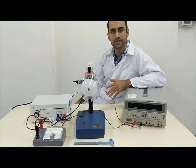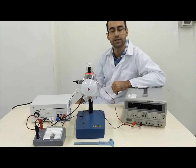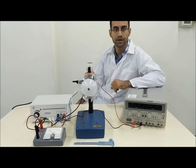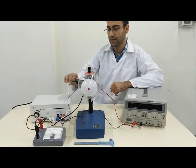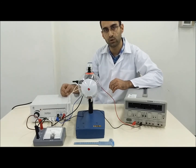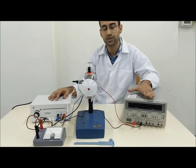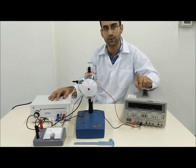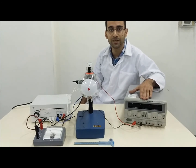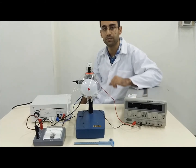The second part of the lab uses the electron diffraction tube, where we will do the diffraction experiment. Connect the circuit based on figure two: this tube receives the same fixed heater voltage as the first tube plus the accelerating voltage. This tube is sensitive to current, so we connect an ammeter and use a reverse bias supply to limit the current. The voltage and current from the reverse bias supply do not need to be recorded — it controls the intensity of the electron beam and protects the tube.